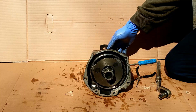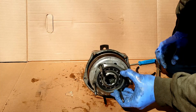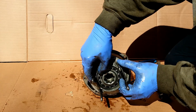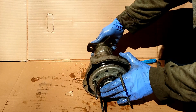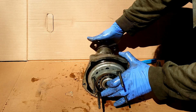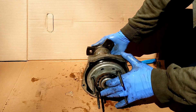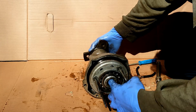From first to fourth gear selected, the internal friction surface of the sliding clutch is pressed against the ring gear. And we remember that the sun gear is locked with the sliding clutch. In this setup, the gearbox shaft turns the unidirectional clutch and engages with the ring gear. The ring gear is locked now with the sliding clutch and the sun gear — everything turns together as one piece. The gears turn together but they don't work as a planetary set now.